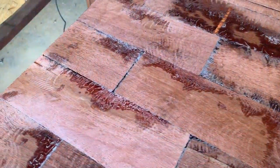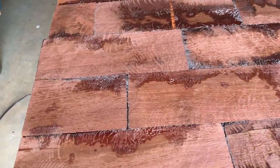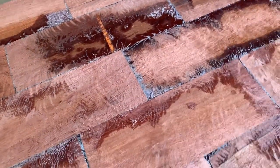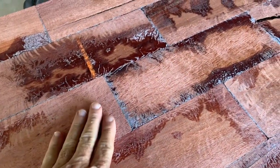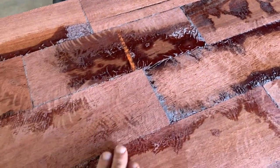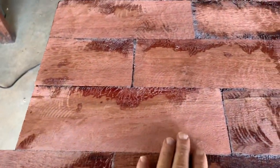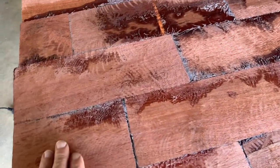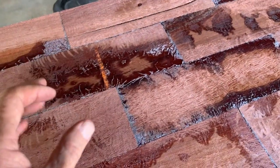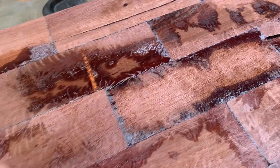The trick is to not go too aggressively with the power unit and the planer too soon. You'll see that some spots I've taken off quite a bit of material - that's because that spot is low and that one is high. The idea is you take off all the high spots first, then check it, and you'll find you can get it really nice and level. When you set it, you want it cutting but flat, then take off all the high spots, and later you can go a little bit more aggressive.